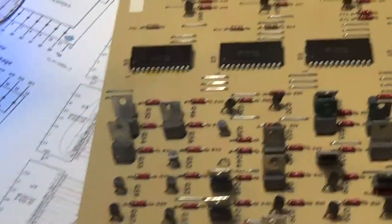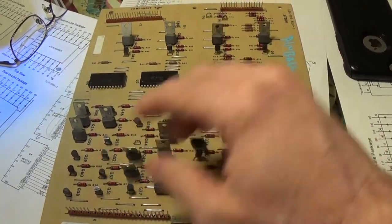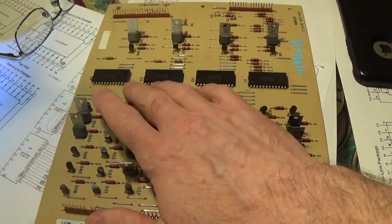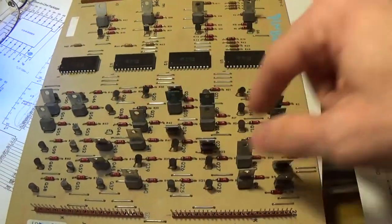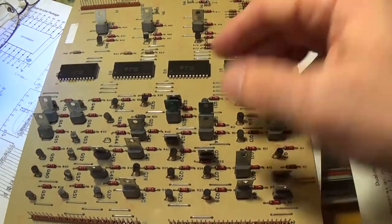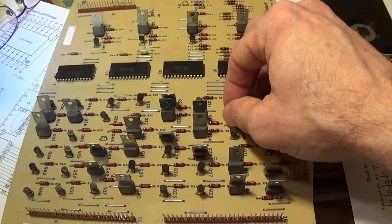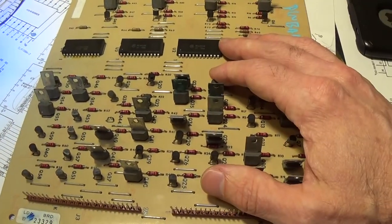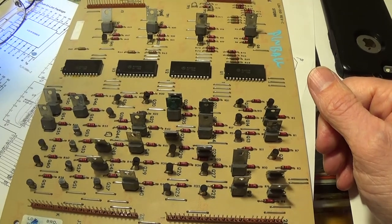With this particular board I have my work cut out for me — there are so many things wrong with it. I'm going to go to the other board first, which only has three or four lamps not working and is much easier to fix. For this one I have to order more SCRs and test all the traces as well. The decoder chips on both boards work fine, so it's just some traces or the SCRs. You go one by one, figure out which ones are blown, then desolder and replace with new ones from Marco Specialties or Great Plains Electronics. I hope this video helped you out — see you next time, bye-bye.